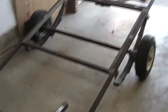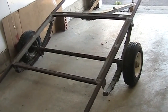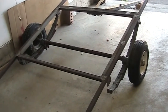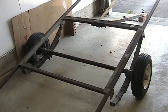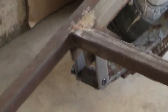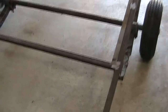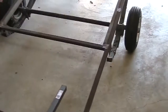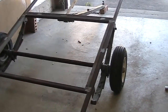A bit of an update — we're partially assembled. You'll notice I don't have the suspension connected at all four points. It's not because the axle is twisted; one of the leaves is more open than the other. I'll still have to crank it down with a ratchet strap to get it connected — the bolts are a very tight fit through the nylon sleeves. I was hammering to get it through. I just want it to support its own weight so I can test how it articulates, and it does exactly what I want. That tire wasn't holding air, so I cleaned the rim, put some goop on the inside, blasted it full of air, and I think it's good.